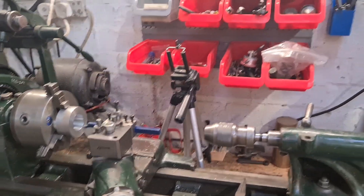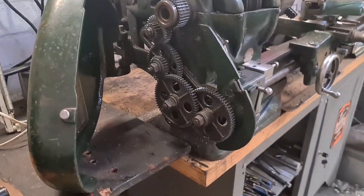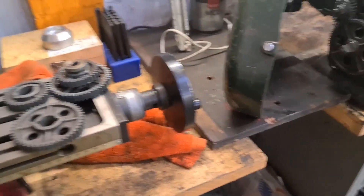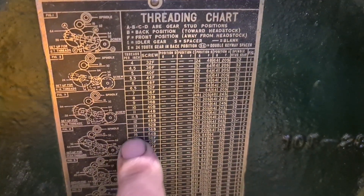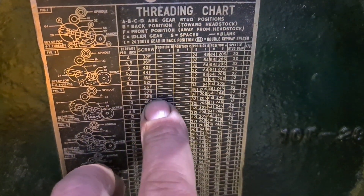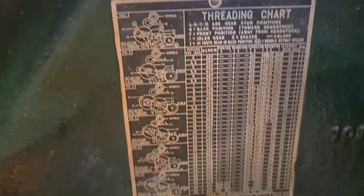I've just got to get into the dark arts. I know that between these gears and two or three that are already in there, I can make it cut 8 TPI according to the sheet which is inside the lid here. 8 TPI. And here we go - screw 32B. So that's this top one. 32B as far as I know - it might be that one actually. I don't know, I'll look proper and work it out.